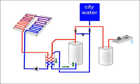Meanwhile, cold city water is pulled into the bottom of the solar tank through the Enerworks heat exchanger. Why through the heat exchanger? Mainly so that any particulates in the heat exchanger will be cleaned out. These will be deposited in the bottom of the solar tank and are removed by opening a tap at the bottom of the tank as needed. That's an Enerworks feature. Oh, one last thing, in case you notice that the water flows in two different directions through the heat exchanger depending on which of the cases is happening, there's a special Enerworks patented backflow valve here which takes care of this.